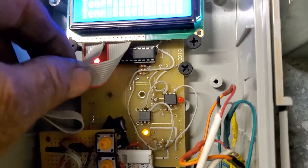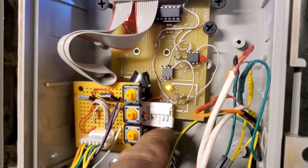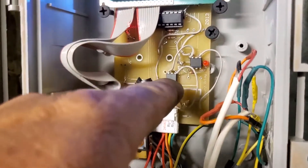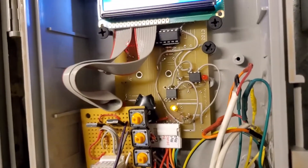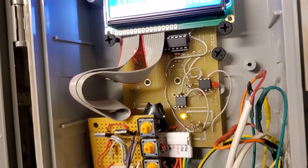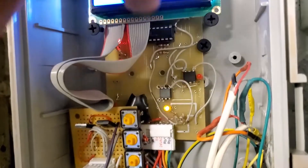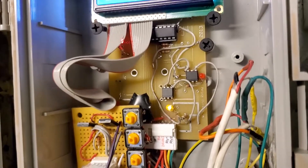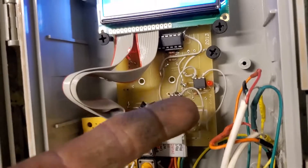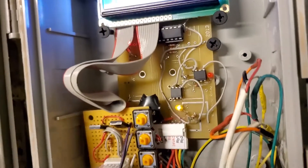I have a Microchip brand processor back there with the various inputs going to this plug. On the last three connectors, I have 24 volts coming in to the TRIAC outputs of these optical isolators. Optical isolators are basically a light-emitting diode and a phototransistor all in one casing, so there's no electrical connection from the input to the output. Light literally emits inside and shines on the receiver, which biases the transistor — or in this case, the TRIAC output, because it's for AC power. So 24 volts AC switches through that.